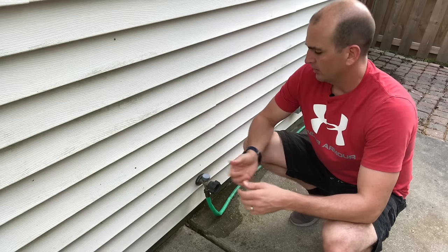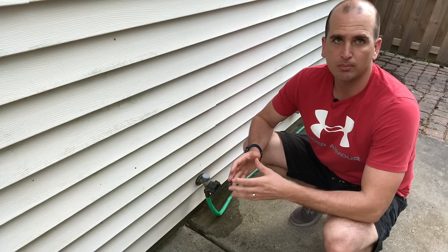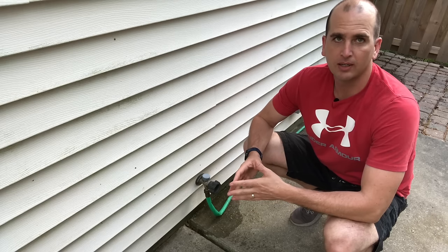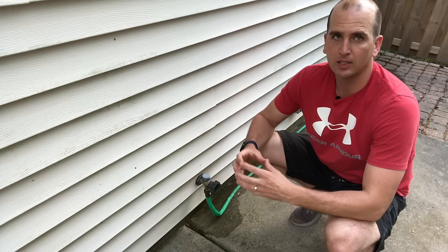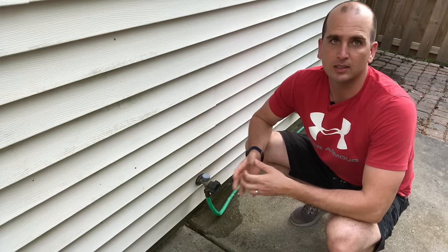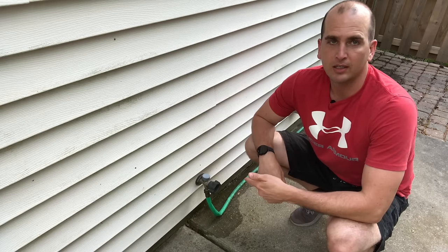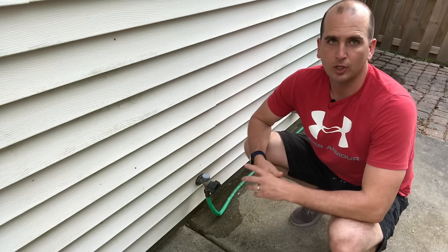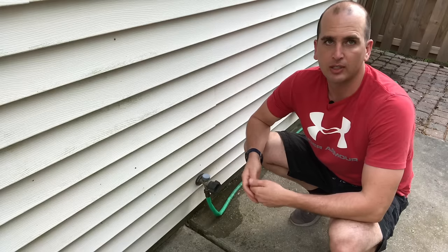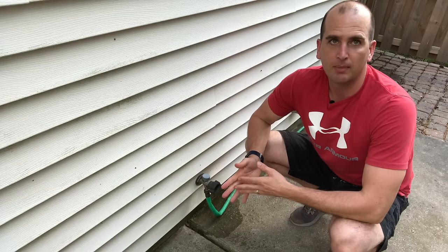So a few things. This can be just some debris in that small little plunger preventing it from seating correctly in the small casing, or there could be some other malfunction. It's a pretty cheap part. I'll show you how to pop off that cap, pull it out, and we'll show you a repair kit or how to look at the part you currently have to see if you can just fix it by removing some debris.